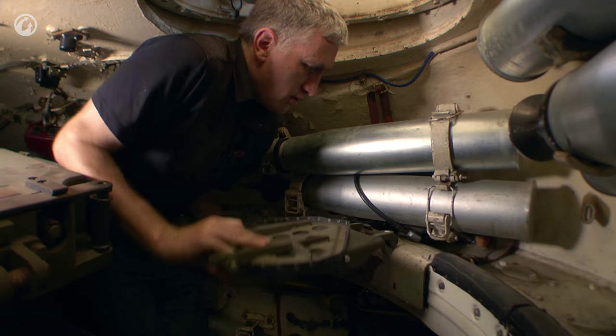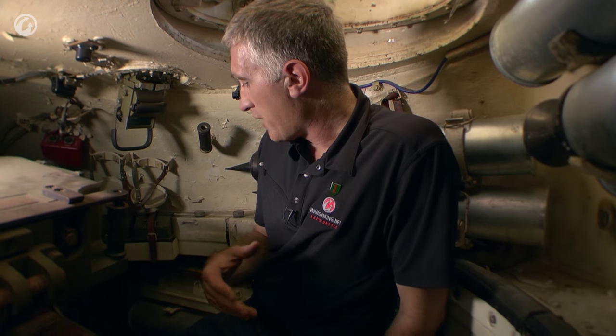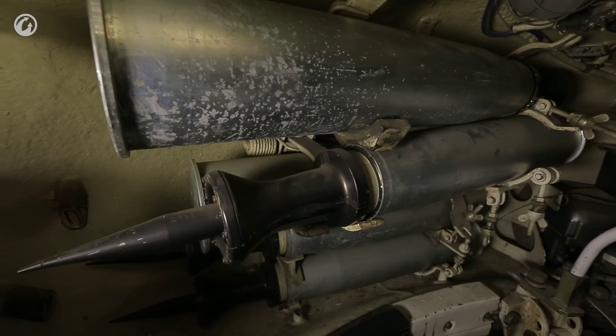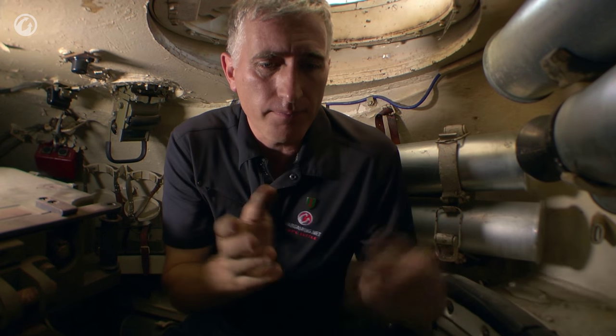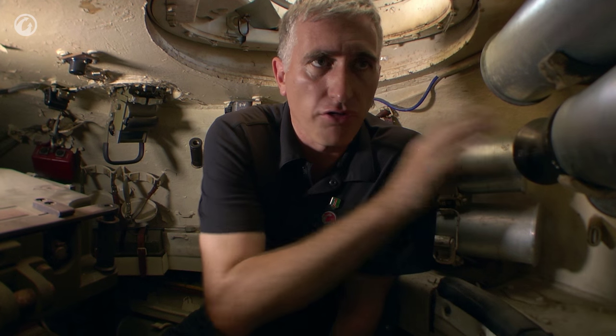You simply lift it out of these little hooks, and there is an additional place where you can sit facing to the front. The loader has a lot of ammo — or at least it seems that way. In actuality there's only about 34 rounds. When they removed the bow machine gun, the ammunition storage went up. The rounds are stowed everywhere: there are five on the rear turret wall, two beside me, four on the floor next to them, and more in the lower rear turret. They're stowed nose to tail and vertically — the base of one round is on top of the projectile of another. They do that because the rounds are tapered, so you can fit more into the small space.